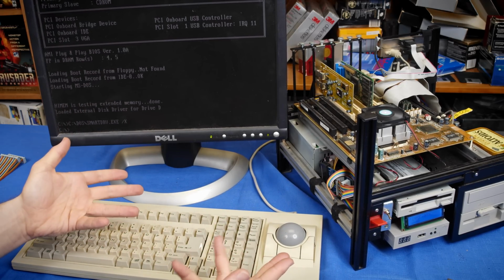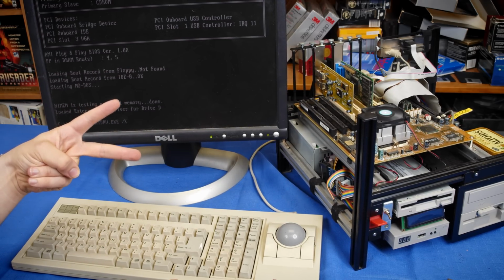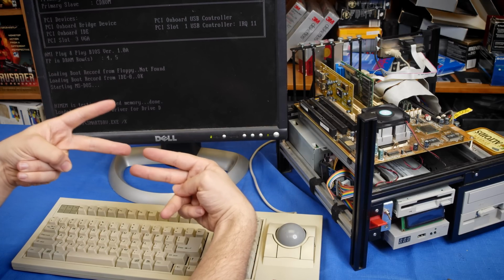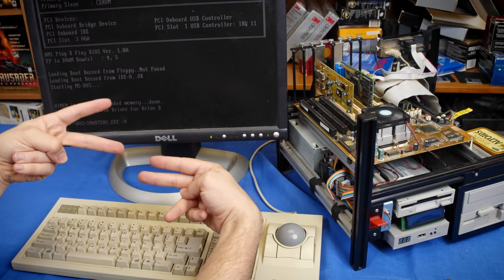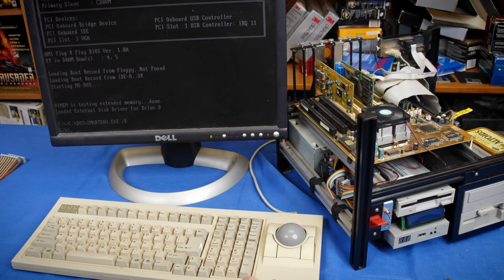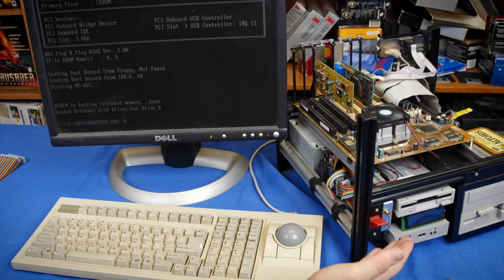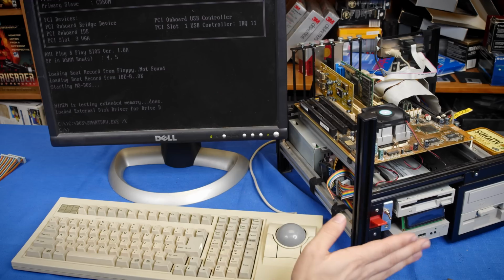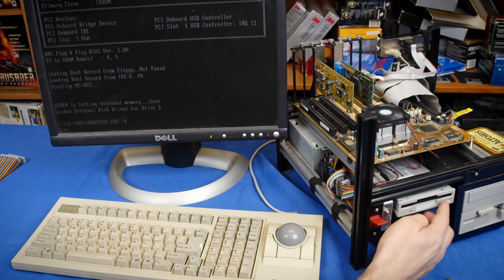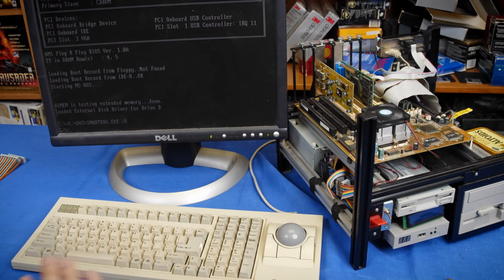Now, as far as the operating system is concerned, we have 2 actual floppy drive interfaces, but on one of them, we have 2 floppy drives connected, and it does know this. But there is no way it can know which is which. So it's going to be on us to arbitrarily designate which one of these is the real drive A interface and which one is the drive D virtual interface. So I'm going to say here that the GoTek is the real A interface and that the physical drive there is the one that is accessed through D. So let's go ahead and try this.